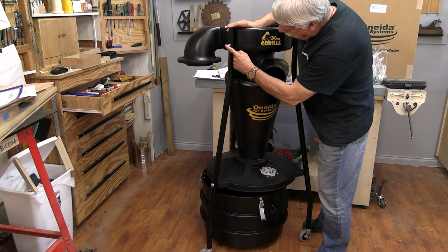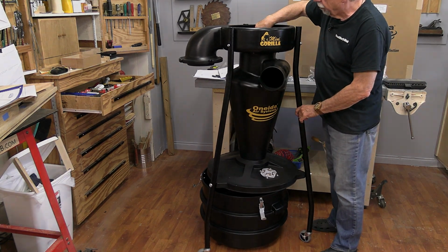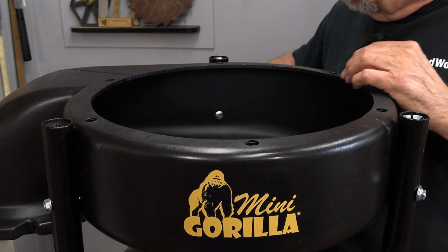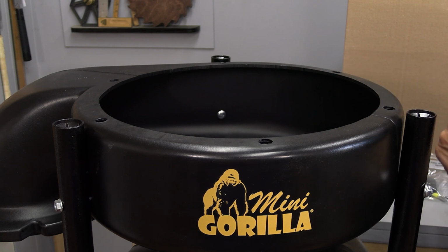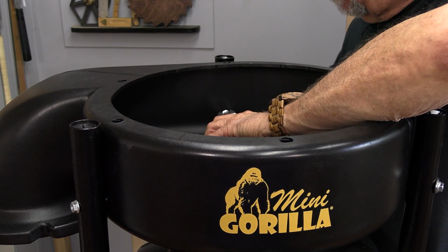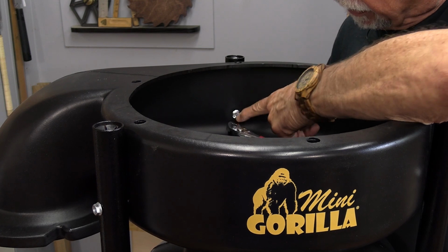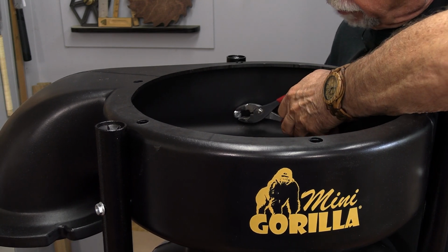Now I've put the legs together and set this all up. I put some bolts through here and here on each leg. But let me show you this for a second. At the top here, there are carriage bolts, and you can see when I try and tighten them, they're just going to want to spin a little bit. So what I found I had to do was to just use some pliers and hold on to that, tighten that bolt up a little bit, and that draws the head of that into the plastic so that it tends to want to hold on a little bit better.